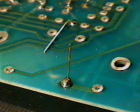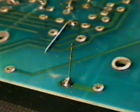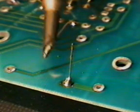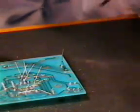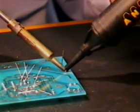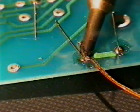If there is a block or bead of solder on the joint, it may be that you have used a bit too much solder. Try reapplying the clean soldering iron tip. Melt the solder around the joint and remove the iron, taking some of the solder away on the iron. If there is still too much solder, use a solder sucker or desolder braid to remove the solder and start again.